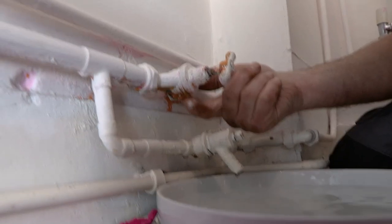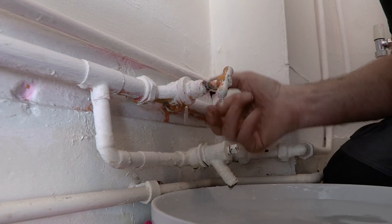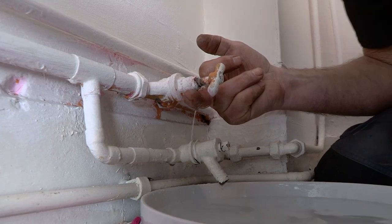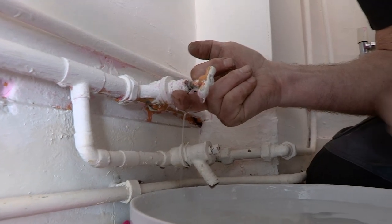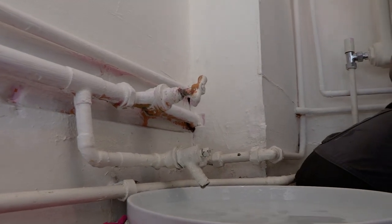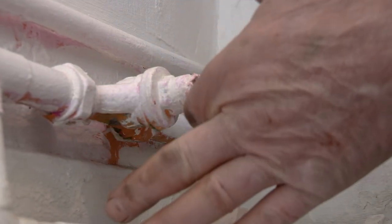It looked like the joint was sealed with paint, so it looks like it's coming out of there, but in actual fact it's running down here. If you put your finger on it you'll see it stops running behind your finger on that side, and now it's running there. This bowl is getting very full, so the householder would have to keep getting up all night emptying it. That is what I would term an emergency.